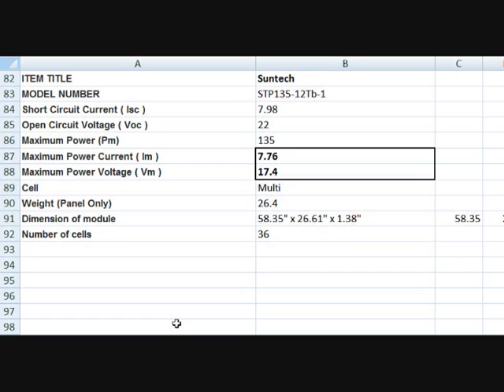What I wanted to cover today was wiring — something I've got to figure out for my own case. I took the 135-watt SunTech panels I just got and looked at the specifications to give me some starting points for cable sizing. A couple of the key numbers you have to look at are the maximum power voltage — which is the ideal voltage the panel operates at, in this case about 17.4 volts — and at that voltage, the maximum current it should put out, which is 7.76 amps.